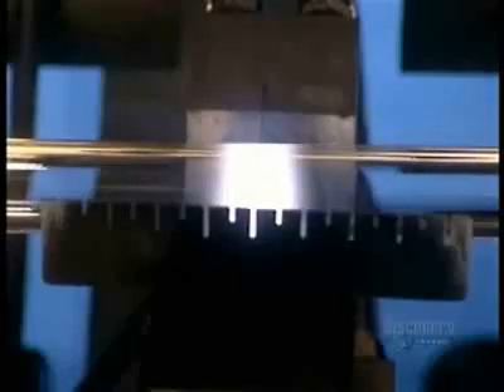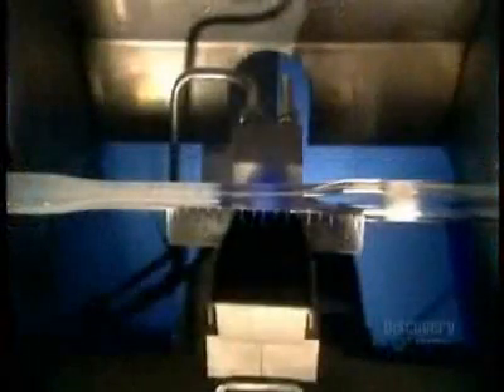As the gases heat, they undergo a chemical reaction that leaves a white soot on the inside of the glass tube. The heat fuses the soot, forming what will eventually become the core of the optical fiber — the glass tube itself will form the fiber's covering. When there's enough fused soot, they turn up the heat until the soot itself turns into glass.